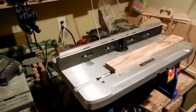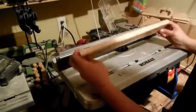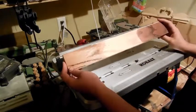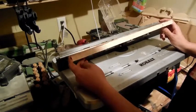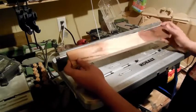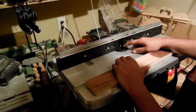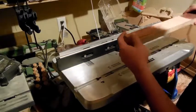I'm starting to work on some of the parts for my drawer and the runners. I've just pulled out a piece of scrap that I had tested my stain colors on. I'm going to use this for the front edge underneath the drawer front, and then I'm going to put a nice trimmed edge on it. I've got a cove and roundover bit in here.